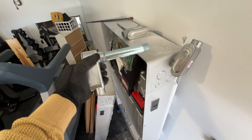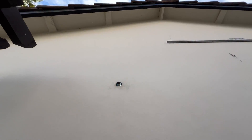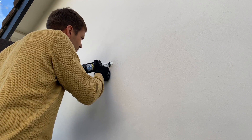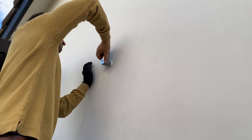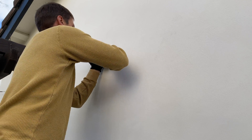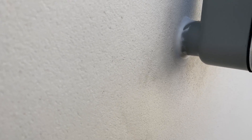To connect conduits together from inside and outside of the garage, I'm going to use a 3/4 inch LB with a 6 inch nipple, and it's just the perfect length to connect two LBs together. I'm using outdoor rated sealant and I'm going to reseal it one more time in a few days when the sealant is dry.